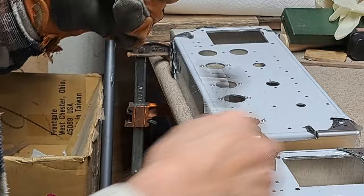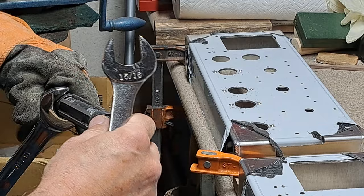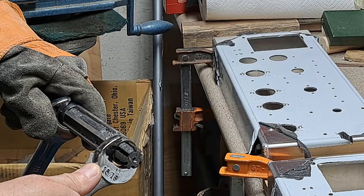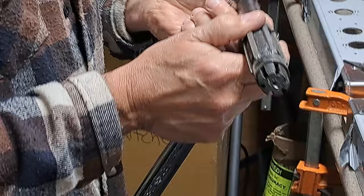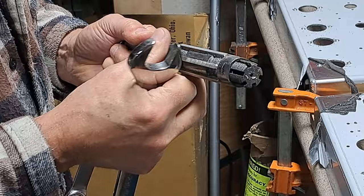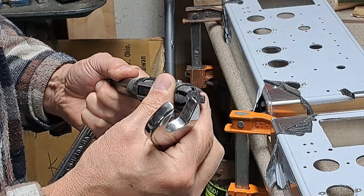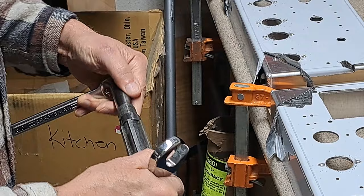I'll take two or three turns and bring these blades out — any machinist watching knows what one of these is. But you guitar guys probably have never seen this tool. I have because I've been doing machine work. What you want to do is you want to make this so it doesn't fit in the hole anymore — but just barely not fit. So you're just shaving it off a tiny little bit at a time. So now that probably won't fit in that hole. See, that doesn't fit in that hole.